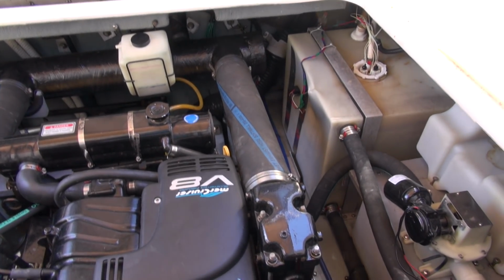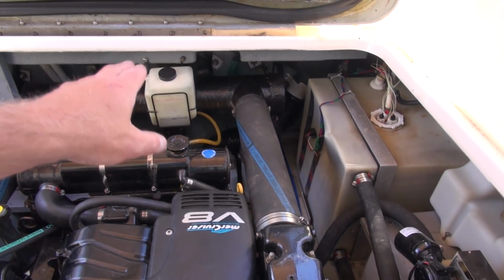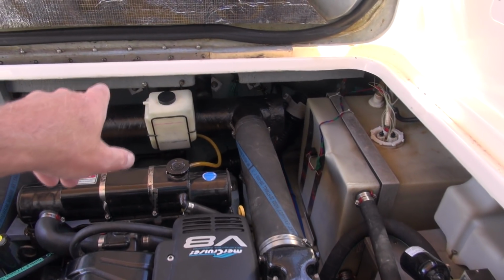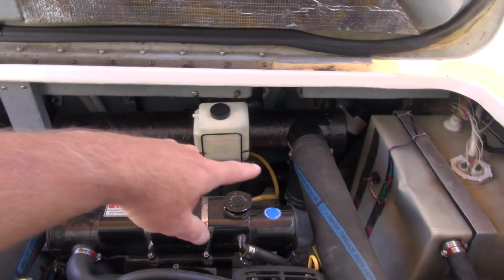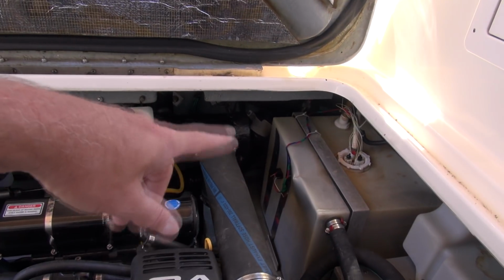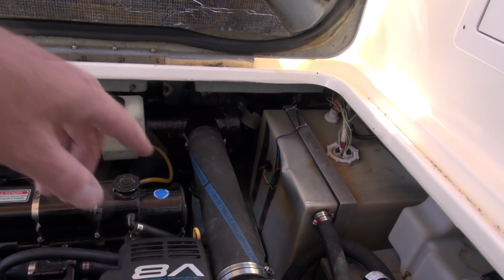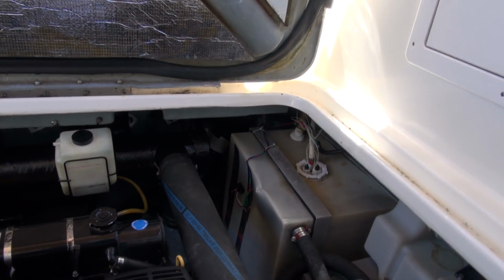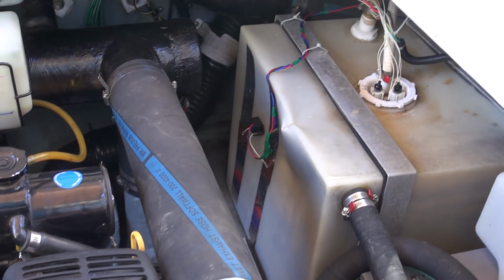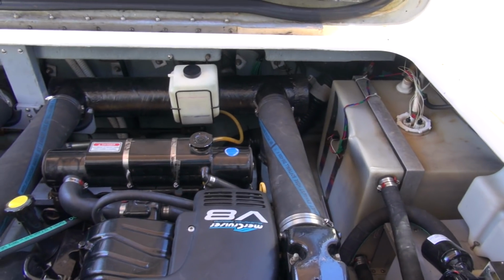So what I'm going to do first is take off the exhaust. So I'm going to take off the overflow reservoir for the coolant system, and as well I'm going to take off this part of the exhaust, the crossover, and of course the section that runs down below the boat itself. And then I'm going to take off that beautiful gauge that I put on the boat, and I'm going to leave a link down in the description and show you how that went in, how it works, and how awesome it is, and how it is reusable, and how I installed it. But first of all, let's take this exhaust out and start getting my hands dirty.